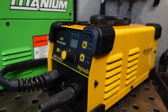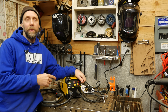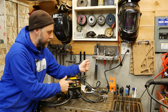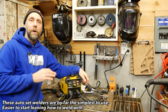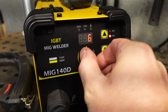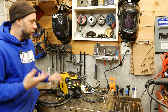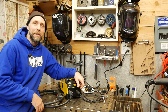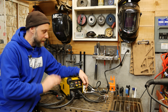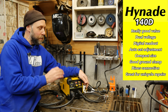I do like the way this one welds the most out of all the welders here. It's dual voltage so you can take it up to 140 amps on 240 — no problem, it does fine with that. On 120 volts you can't go up as high with amps. Like the Yes Welder, it's auto-set — you can dial it down or up, which is really nice. It's got an amp readout on the front. The auto-set on this machine feels the most dialed in compared to the Yes Welder — it's very precise. If you don't like the way it's feeding, you push the side button and you can offset your voltage in tenths of a volt, but I found without fiddling with it, it works just fine. It's the most affordable, selling for about $154 on Amazon. I've welded quite a bit with it and it's buttery smooth. For a flux machine it kind of changed my mind — I've always felt they're pretty splattery and smoky, not the best, but with the right wire in these machines they run really smooth.